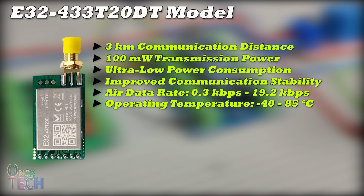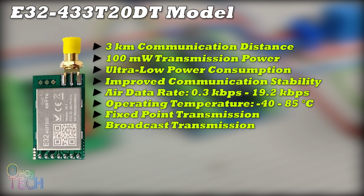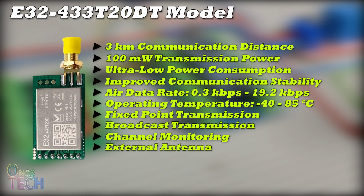The module can be configured for fixed point transmission, broadcast transmission, and channel monitoring, with a provision for an external antenna. Several of its features can be modified with the software RF setting tool. Among the many good uses of the module, Internet of Things applications will be considered in subsequent videos. More details on this LoRa module are available in the data sheet via the link in the description.